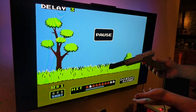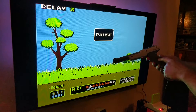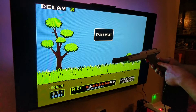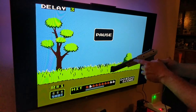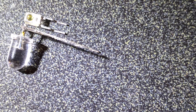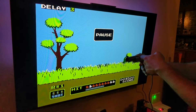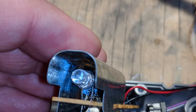The plastic's cheap — it doesn't have any weight to it. But I wanted an original gun to work. So I thought about it for a bit, looked inside, and it looks like a little LED bulb that sticks in the Tomy gun right here. So I took it out, soldered some legs onto it, and put it in the Zapper. If you look down the center with the right light, you can actually see that it focuses in the right spot — you can see the little sensor down here. That lines up. I'll put a couple pictures in here too to show you what I did. It's really simple and it works great.